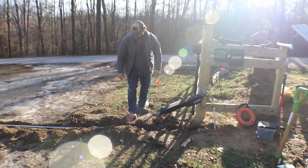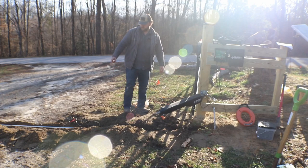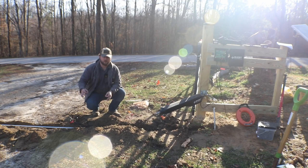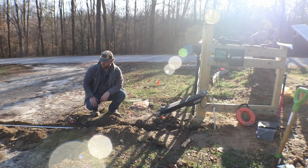So it's a steel fish tape. We've already taped up the end of the wire. Whenever you guys are using one of these steel fish tapes too, you're not going for multiple wraps. You're going for coverage of wraps. So do like a third to a half coverage on it as you wind up the steel tape through the wire, just to make sure it doesn't come loose. Short pull like this, not going to be a big deal.